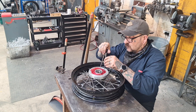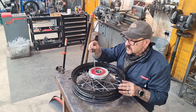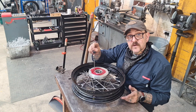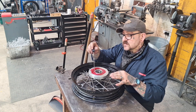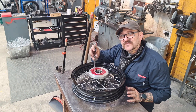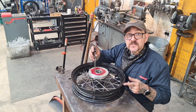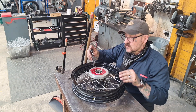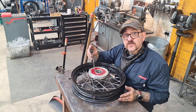When you get back to the beginning, you'll either be a little bit over or a little bit under. There are five holes, so you get a fifth of that difference. If it looks like a 10mm gap, then move 2mm. Try again — within two or three goes you'll have it pretty much nailed.